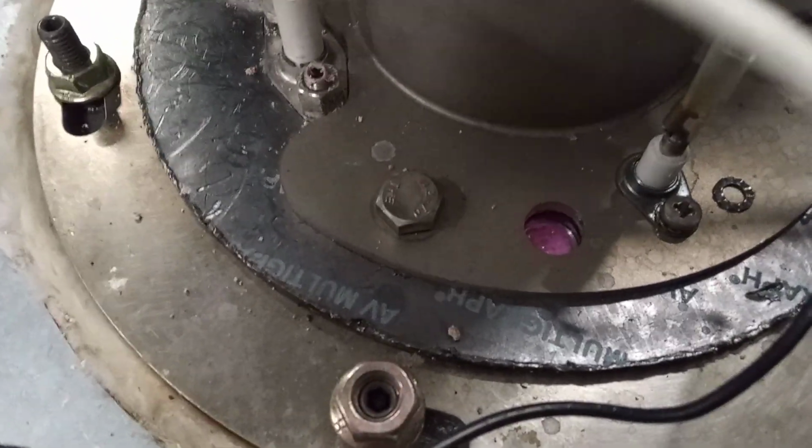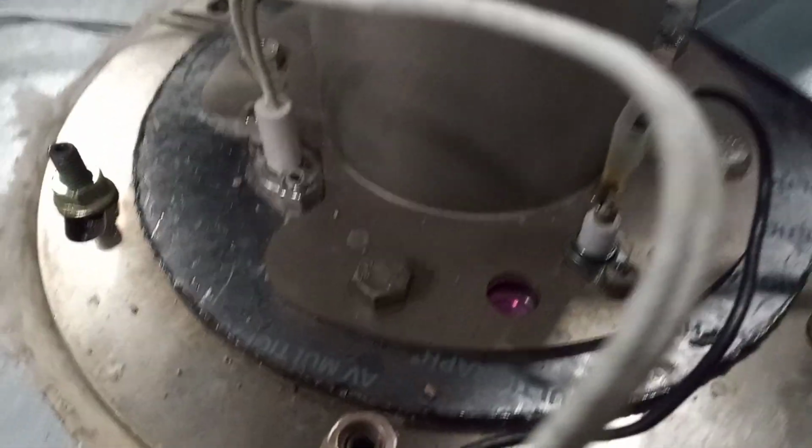and so on. Over to gas-fired water heater 1. So I checked the resistance on this one here. I took the probes out, gave them a clean up, came round and took the condensate trap off, gave round here a hoover. I was about to take the flue out and hoover the flue as well on the gas-fired water heater number 1.